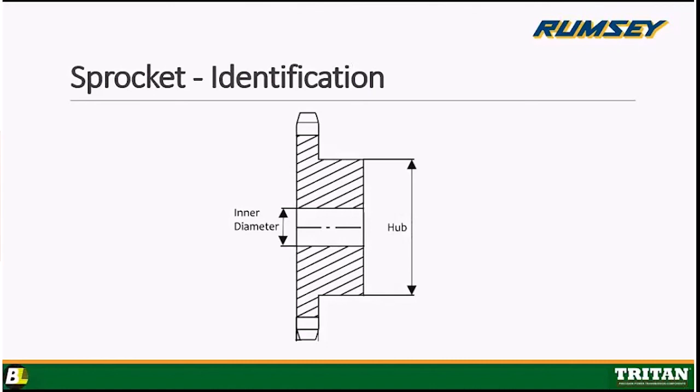Here's an example, Dave. I had a spherical roller bearing here, not a ball bearing, but as you can see, it's a double row spherical bearing with a bronze retainer. You do not want to be handling this thing with your bare hands. If it's not the right bearing and you put it back, it will end up with corrosion on it just from the moisture on your hands. That's a $250 bearing I hate to see you destroy. The oils and whatever moisture on your skin will eat away right away at those bearings.